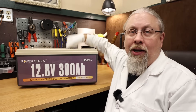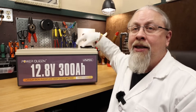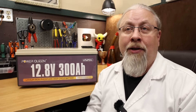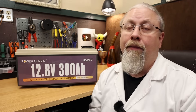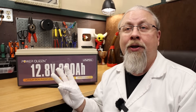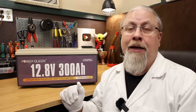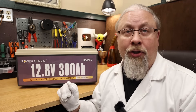The case is all ABS plastic all the way around. It is completely sealed and rated IP65 water resistant, so it is fully resistant to normal outdoor weather conditions, but it cannot be submerged. The battery management system protects against overcharging, over-discharging, over current, and short circuits. There's also built-in overheating protection, which we're going to test out, but it does not offer low temperature charging protection.